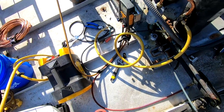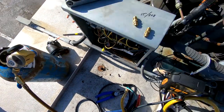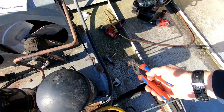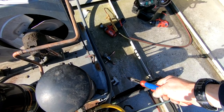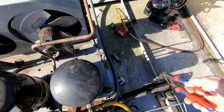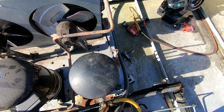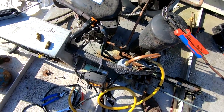What makes the job so much easier is if you got one of these regulators - just set it for purge and she does her thing. I wouldn't say it's necessarily a defective valve, but even though that was plugged up I'm not taking a chance putting it back in there. We could have taken it apart and possibly cleaned it, but not all of them necessarily have that screen. You've already taken the whole refrigerant charge out, so a lot of time wasted. I still stand by changing the valve and being done with it.